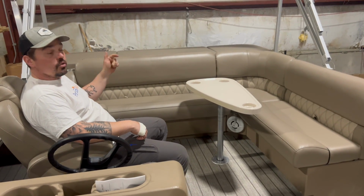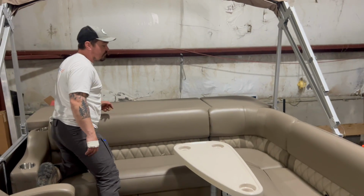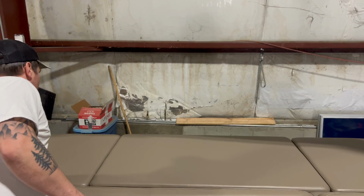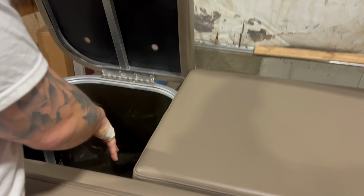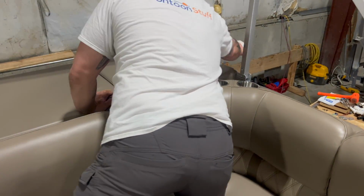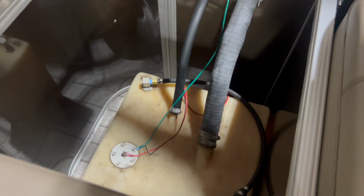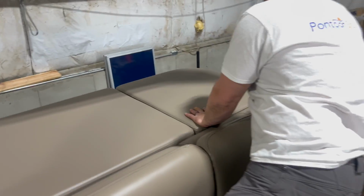If we take a look at the new railing kit, what it includes is this sun deck kit. So this is an 8 foot wide, 17 foot long, full sun deck kit. We have an enclosure for our battery on this side. You can see our battery down there. And then on the other side, we were able to reuse this customer's fuel tank. It's about a 15 gallon. It's a little smaller, but perfect size for this. We tied in new fuel fittings to the railings.